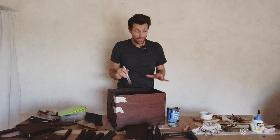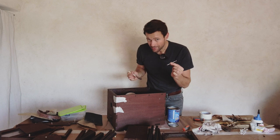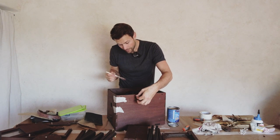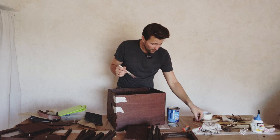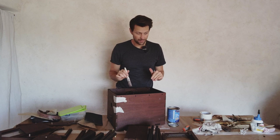I painted the inside of the box as well as the inside of the lid. Through the dowel holes we haven't used yet, just use a cotton swab placed inside to make sure there's no pooling of varnish — if that dries or becomes sticky it's really hard to get out. Depending on your varnish, it will take between one and two hours to be touch-dry. While this is drying, we can varnish the tripods and basically everything else.